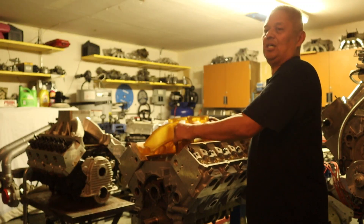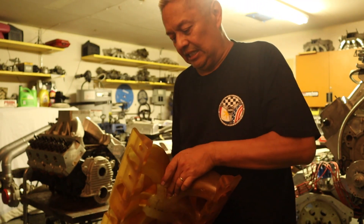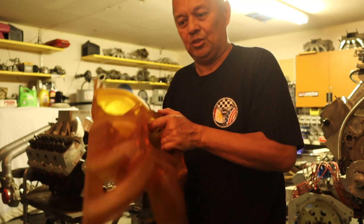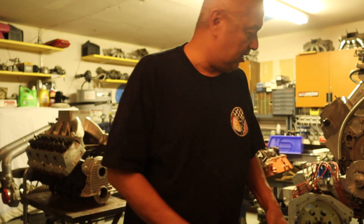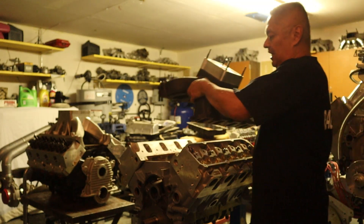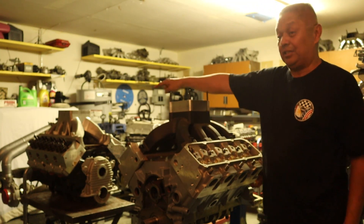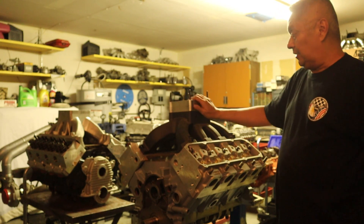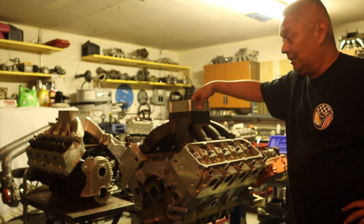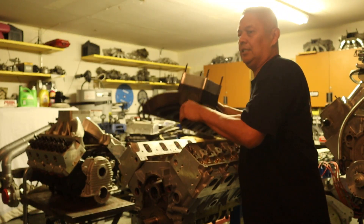When these things are evaluated, I know they use this kind of plastic-type manifold that they can easily carve and make a test piece before they go to the serious ones. What I have here is one that I ran 10 years ago. Look how tall that is compared to the other one. It has a spacer plate on top that's really somewhat permanent in there, and there's no ridge that you feel as far as the flow is concerned.